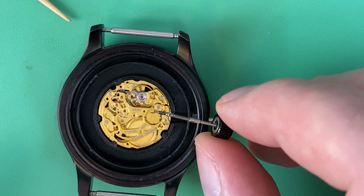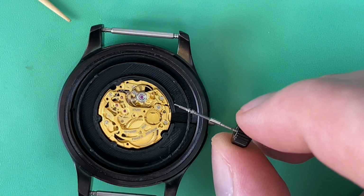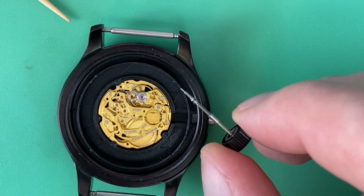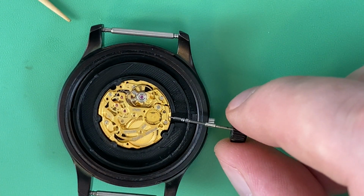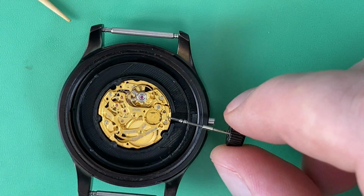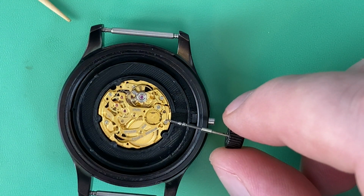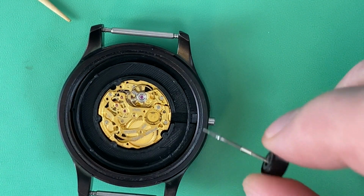There are 2 considerations with that. I try to avoid extenders if I can. I couldn't in this case, but it's not a huge deal. You can use Loctite and it'll function just as well as a stem without an extender. But the first thing I looked for was a stem that fit the Miyota 6T33 that was a little longer. They do make that part. It's the 065489.